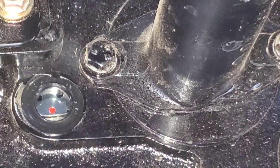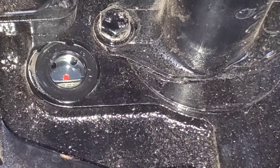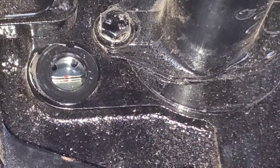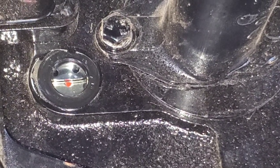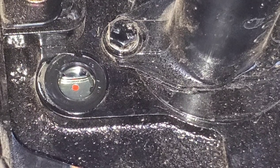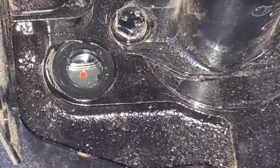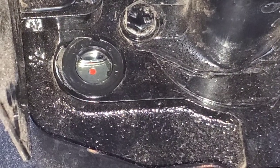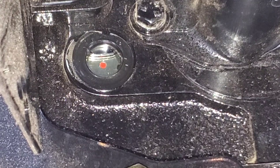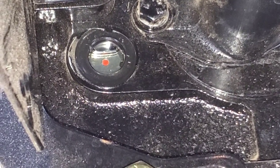Here we are back underneath the tractor. What you're looking at here is a glass window that shows the level of the hydraulic fluid. As I'm pumping it, you see it's raising up. You want to get down here and check when you get close to about four, four and a half gallons and keep an eye on it. That way you've got that fluid in the window. We're going to stop right about there. What I'm going to do is start up the tractor and cycle all the hydraulics — the front loader, the backhoe, the outriggers — move all the hydraulics up and down, extend them back and forth all the way. That'll move all that fluid into where it needs to be. Then we'll come back here and check this sight glass again, and if we need to add a little more, that's the appropriate time to top it off.